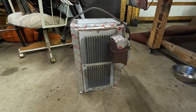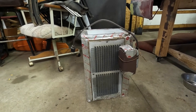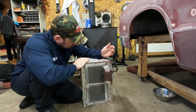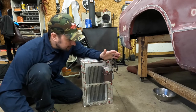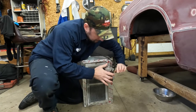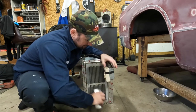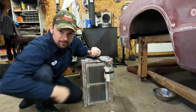This is a homemade dog house heater I made a few years back. It's been working really good. I made this for about 40 bucks. So what we got here is a box I made out of sheet metal. I'll take the cover off so you can see inside. We've got a line thermostat like you'd use for a baseboard heater. I got some scrap flashing over it to keep the dogs from cranking on the knob — not that they would on purpose, but you know they would investigate.